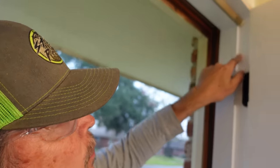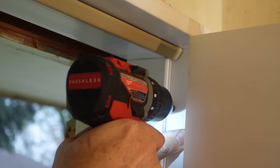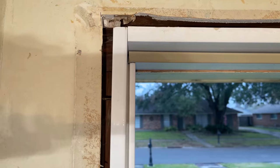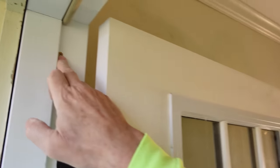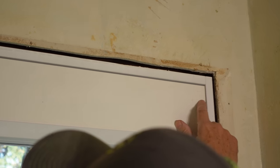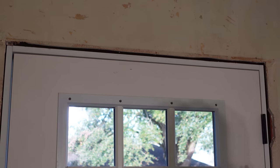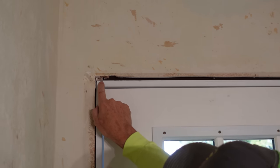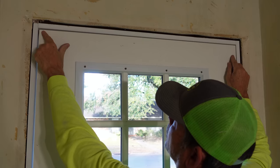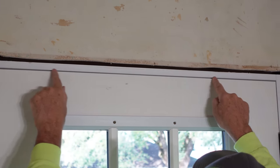I'm pre-drilling the hole for our screws — it's going to be behind the weather stripping, so when we put it back you won't see the screws. We've got one screw way up high on the strike side and one screw way up high on the hinge side, and we adjusted them back and forth, moving the entire frame until our door was plumb. When we close the door and put a level right here, it's plumb. Our threshold is level and the door is plumb. But look at the reveal on the top — it's more narrow on my right side than the left. It may be a manufacturing defect. I'm going to use those screws to correct this gap. That is so much better — the reveal is perfectly even all the way across the top.